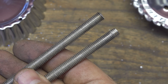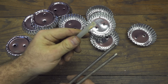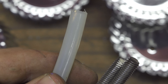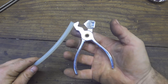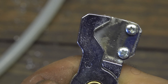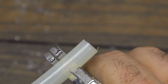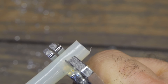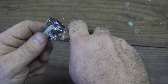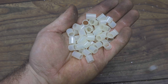Let me take now two stainless steel threaded bars — these are 35 centimeters long — and a plastic tube. The plastic tube is very important because it's used to electrically isolate the two electrodes. Using a scissor I can cut away sections from this little tube, about 1 centimeter long, and I repeat this procedure 20 times.